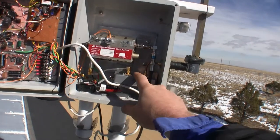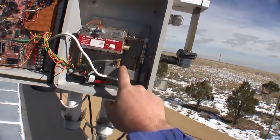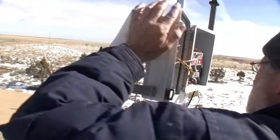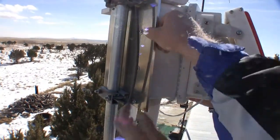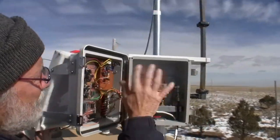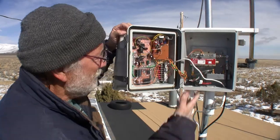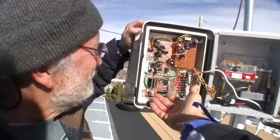The amplifier is mounted to a plate, which is also mounted to the back plate. If you go around back, you can see the whole back of the box is a big plate of aluminum on the shade side — it radiates heat. When we put a shield over it to keep the sun off, we pretty well solved the heat problem. The fan helps cool the stuff here, though it didn't make the biggest difference.